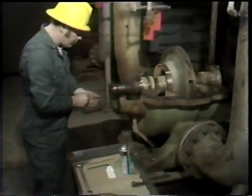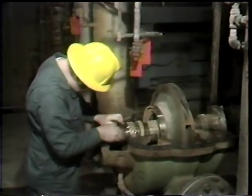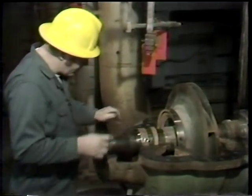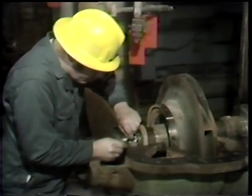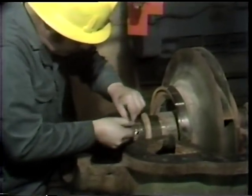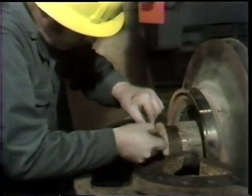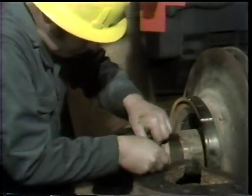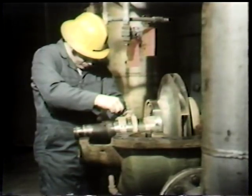After this has been set aside, the rotating portion of the seal is now exposed for dismantling. The rotating element of the seal on this particular pump was clamped onto the shaft, held in place by a two-piece clamp which in turn is attached using a set of Allen type set screws. So the workman makes use of an Allen wrench to loosen these four set screws before removing the rotating element. After all four of the screws have been loosened, the rotating assembly can then be slid off the shaft as a unit.